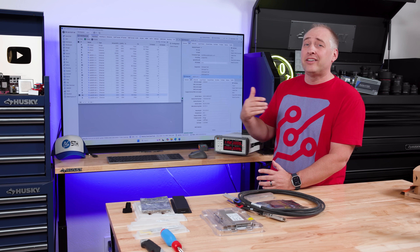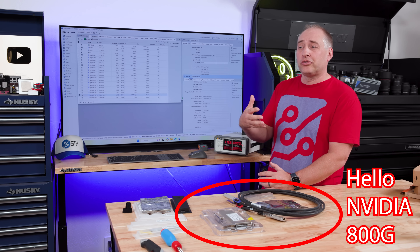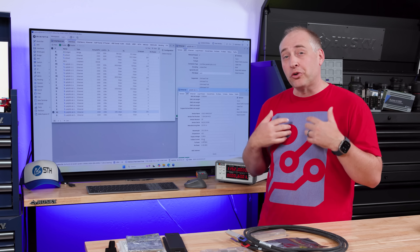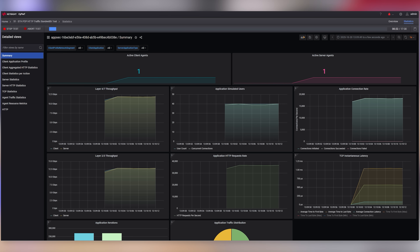When we have high-powered optics that can be 10 to 12 watts each, when you put those in you are going to start hearing those fans — all of a sudden we've added 20 to 24 watts of extra components. The switch is going to pull more power and we're going to get more fan noise because it also has to cool all of that.